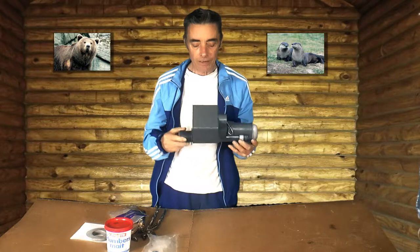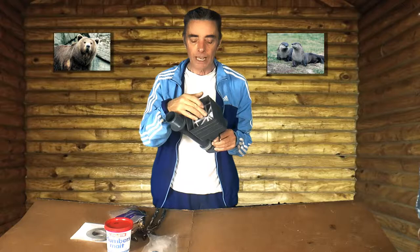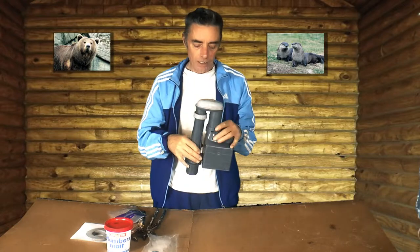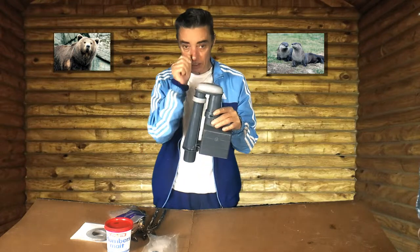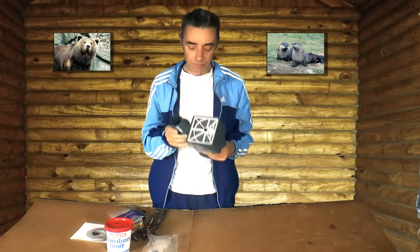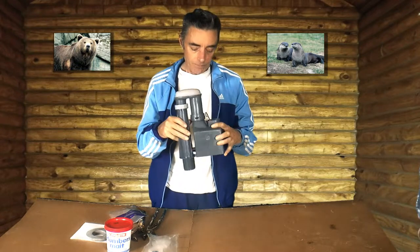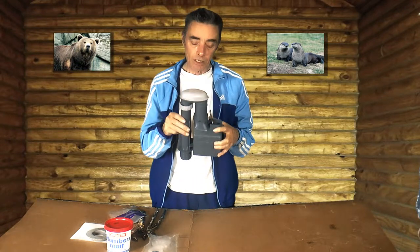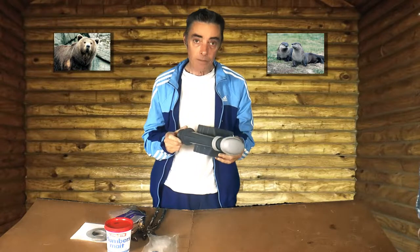I was wondering what could go wrong — had I installed it wrong? You can't really install it wrong. There's only one moving part — the diaphragm — which moves up and down when you pull the handle. It pushes water through and once it gets going it acts like a siphon. So the only thing that could be wrong would be the diaphragm. This was brand new, so I went out and bought another one — a slightly different model, the same make but cheaper and it seemed better made.